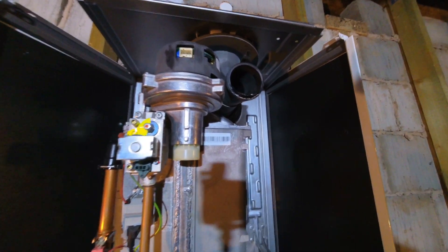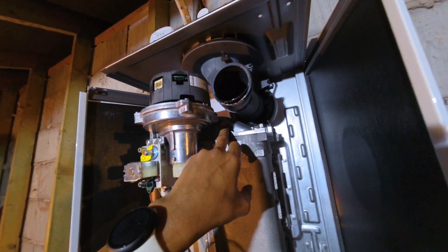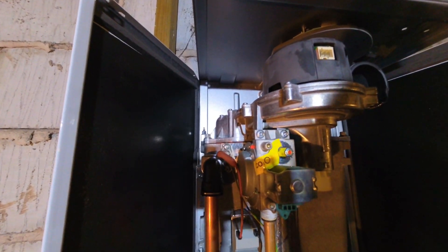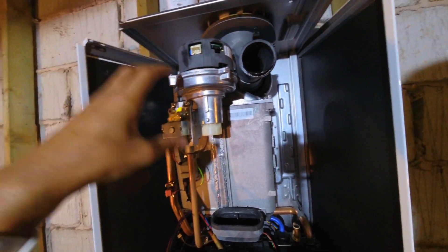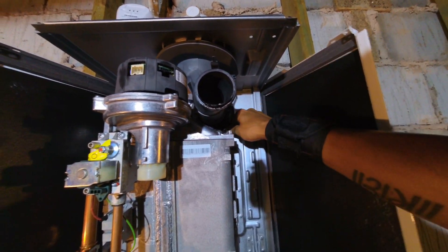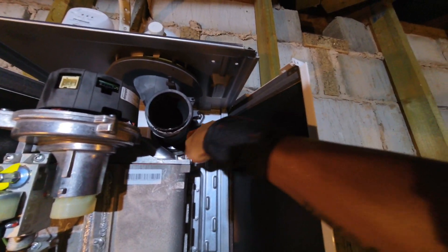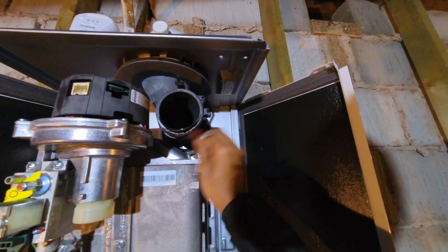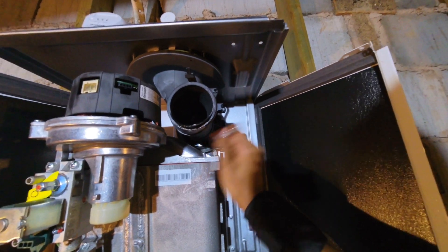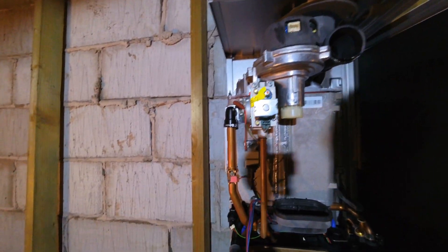The gas is off downstairs so just a little bit of gas was left in there, and that's been disconnected. The whole assembly will come off together with the burner — you don't separate the fan from the actual burner itself. There are four 10mm nuts to take off and then the burner, fan, and gas valve will all come out together as one assembly. A 10mm swivel head will be your friend on this job as it allows you to get a tighter angle. I ended up taking off the left-hand side panel.